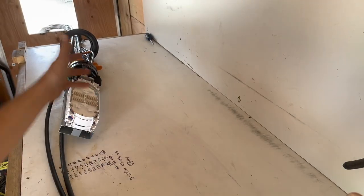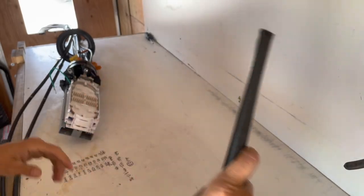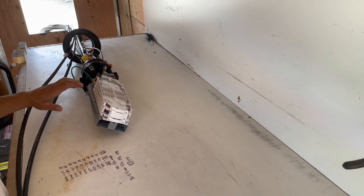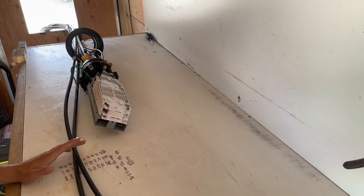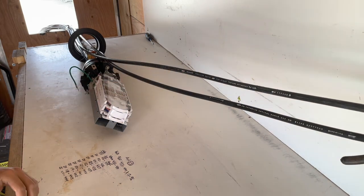Now we've got our cables through the collar. We have them cut to length, which is 5 feet from the ring cut. This is a 450BS closure. You only need 5 feet for these trays on a loose tube cable. If it was ribbon cable, you'd be using 8 feet for your length.